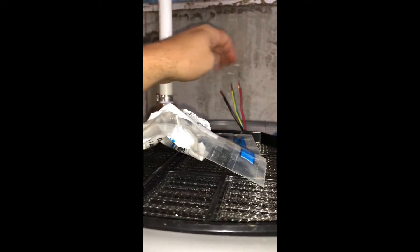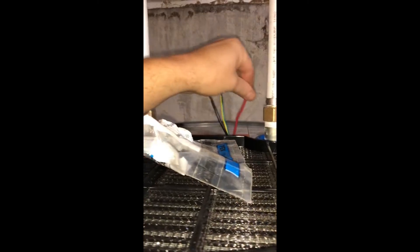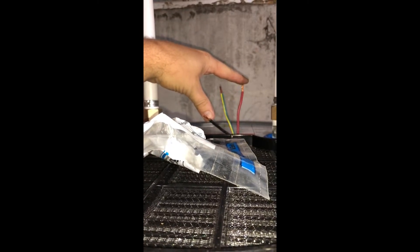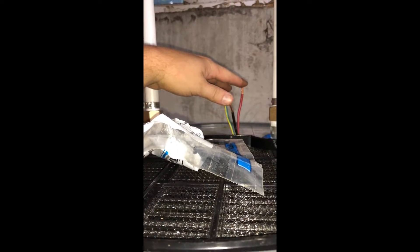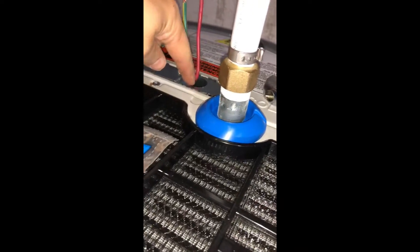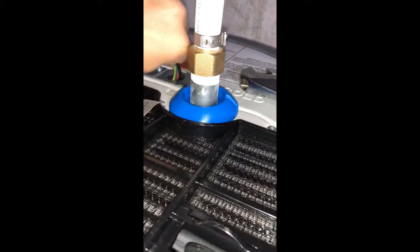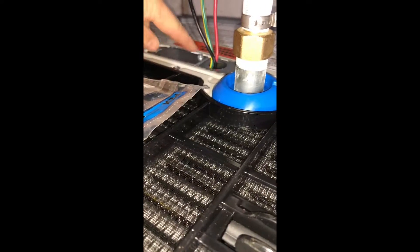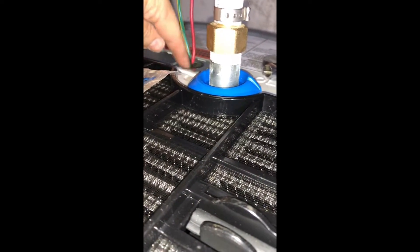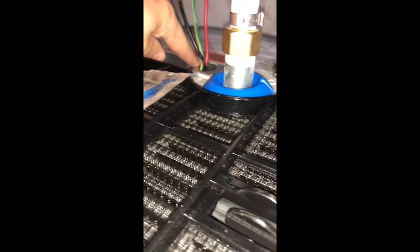We're going to cut this and connect our white wire and our black wire. The white wire will go to your red wire, because again, these are both your power wires - your black and your red are power wires; it doesn't matter which one you hook to which. This is going to be your ground. I've got compression fittings here - the compression fitting is made to fit into this hole and prevents the wires from chafing. We're going to pop this panel off, run our wires in, connect them, and screw down our compression fitting so the wires are safe and secure.